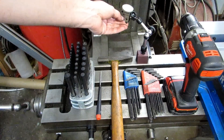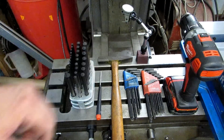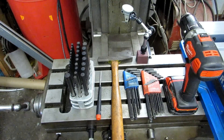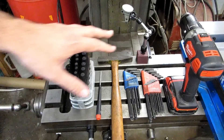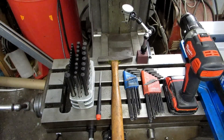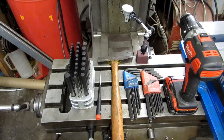It doesn't have to be a dial test indicator — it can be a plunger type — but you're going to need to dial in the scales to make sure that they are square to the travel of the machine, and you're going to need a mag base to hold it on there. I've got this little mini Noga clone right here, which is great for tight spaces, because you generally don't have a lot of space to put a full-size indicator base on there, but you can use one that's just going to be kind of clunky.